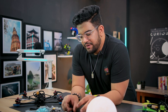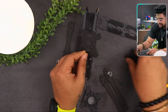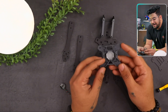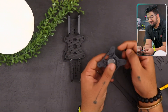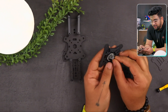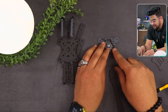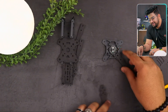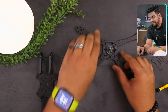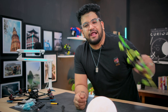So those are all the parts — let's assemble the frame quickly. It's a very easy frame to assemble; you don't even have to look at the manual. Start with the main fuselage — it only has one plate, no bottom plate. The LED diffuser goes at the bottom with the Axis Flying logo that will glow up. The wires are soldered to your flight controller to control the LEDs. Then put your arms — the longer arms go at the back for the dead cat geometry, and the smaller arms go in the front. I really love dead cat frames because the propellers don't come into the picture.